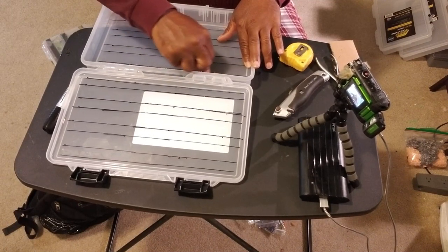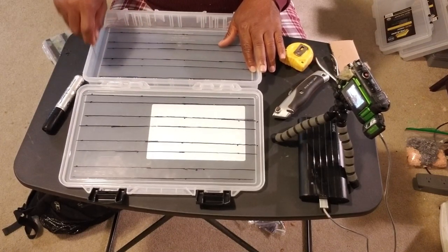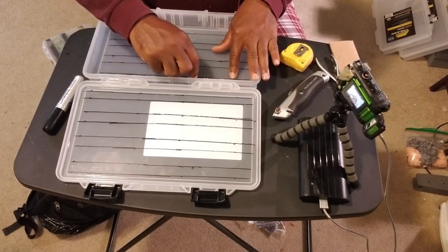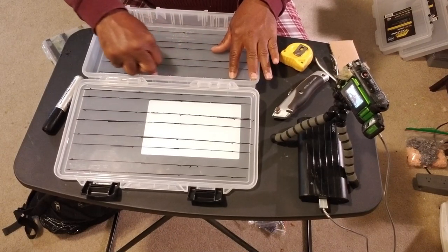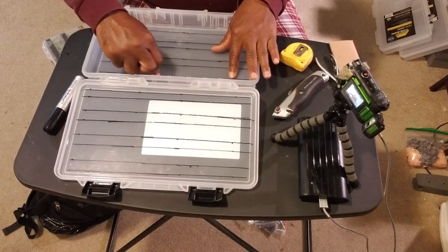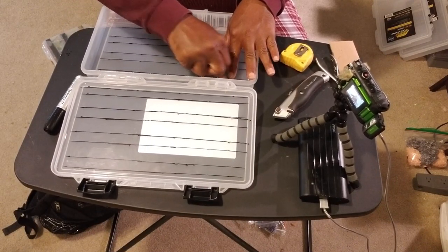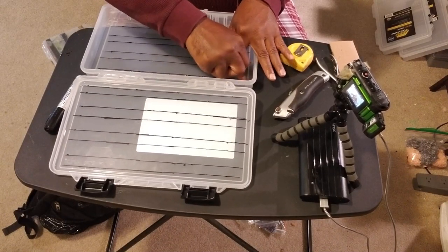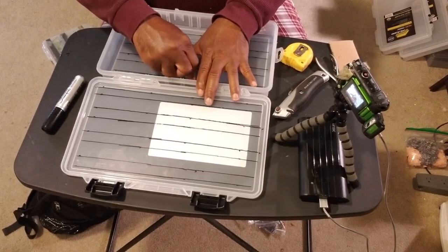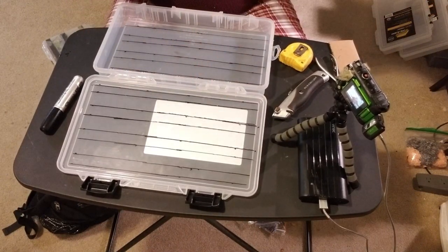What I am going to do is put lines in the box this way, then come back and put a scar coming down within those lines. If you go outside the line, it's not going to hurt anything, because the amount of glue we're going to put on for the foam will seal that scar back up anyway. So just take your time and put several scars on it. You want it rough, and you want to dig in pretty good. I'm using this little knife now, and I'll use anything I can to make this thing rough. I've got a file here too.